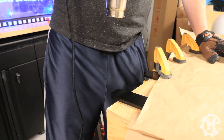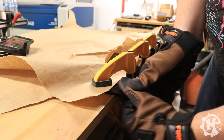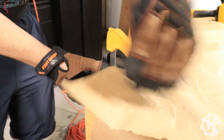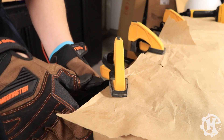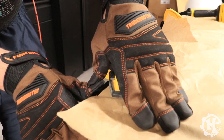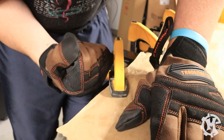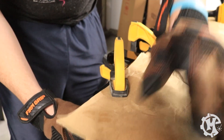I started by using the heat gun to heat up each tab to be able to bend it over. It took a few minutes for each tab to get hot enough to actually bend the acrylic. Once I had the first bend done on each tab I went back through, heated up each tab again, and made the second bend. The trick is to make sure it gets hot enough to bend easily — don't try to force it, and be patient so you don't crack the acrylic. As soon as you let go, it starts to return to its original shape, so you have to hold the acrylic in place until it's cool enough to hold its shape on its own.